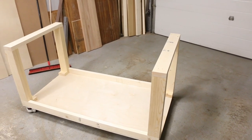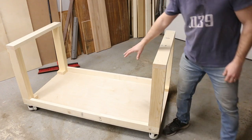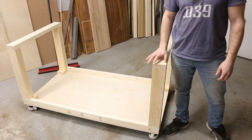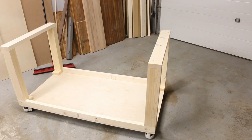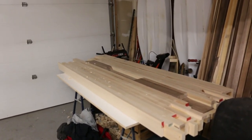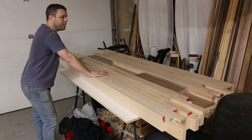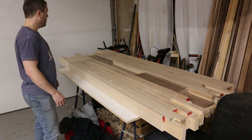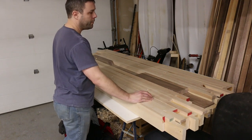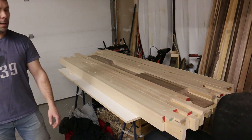The base is done and it's on wheels. The bottom section will get cabinets after the top is on. The top will go on and we'll lag bolt it from underneath the cross pieces. The table top itself is still waiting to be flattened — next weekend I'm taking the whole thing to a cabinet shop to run it through their 48-inch wide planer. They'll do both sides, flatten it down, then I'll trim the ends off so it's square at 72 inches long and 34 inches wide to fit nicely on the base.